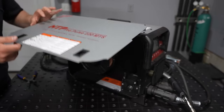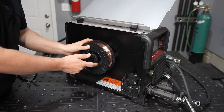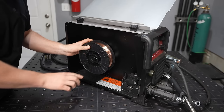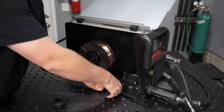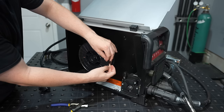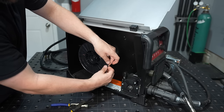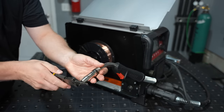This is one of several MIG welders that I have — it's the HTP Pro Pulse 220, one of my favorites. I'm going to remove the solid wire that's in here for welding with shielding gas and just clip it off right here. Some people try to roll it back onto the spool to save the wire, but I think it's just as well to let it go and pull the rest of it out through the end of the gun.